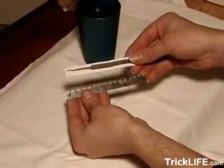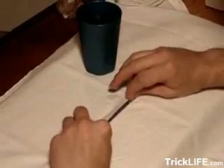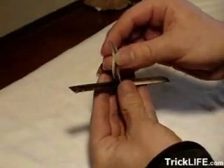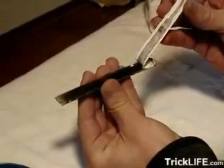If you're using regular paper, dip it in some water and stick it face down onto the hacksaw blade. If you use glossy paper, there's no need to wet the paper — just hold it in place as best you can. Make sure your iron is good and hot and apply heavy downward pressure for about 10 seconds. Let everything cool, then slowly peel back the paper from the metal. If it doesn't come off easily, you can dip the whole thing in water and rub off the paper.